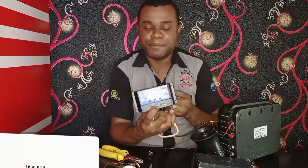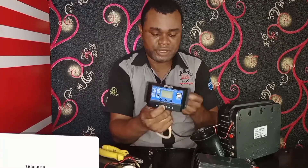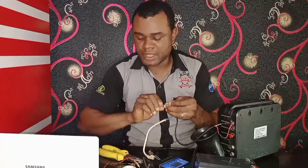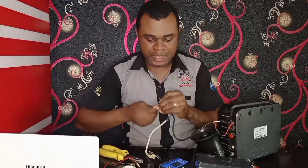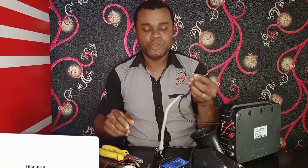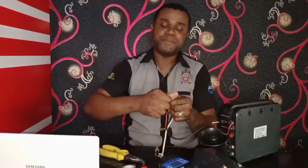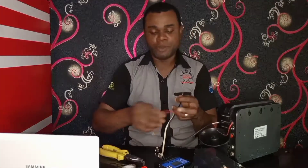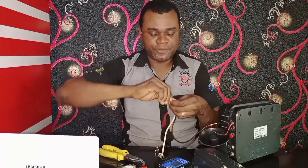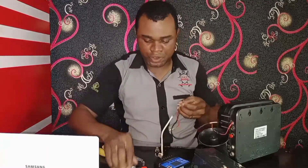Now this is the power for the battery — it's not the load. Most times it is advisable to use the battery connection. I connect the negative to the negative. This is going to the battery terminal. You can crimp a battery terminal into this — I will use this for today. This is the positive from your charge controller and your energizer. I'm now securing the connection to avoid short-circuiting. For the negative, I have also done the same — we have this for the positive.